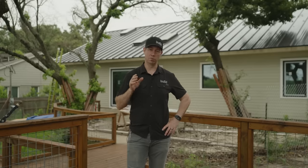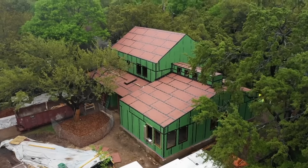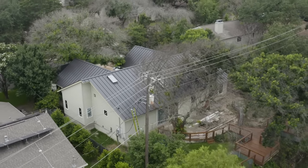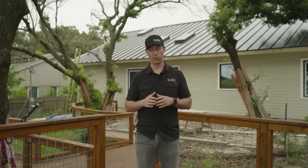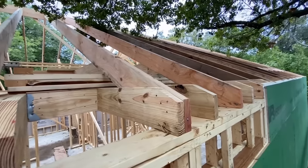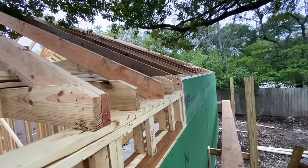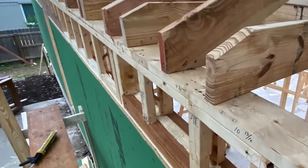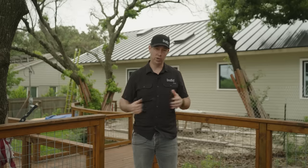We're talking rooftop insulation and metal roofs. Let me review the assembly on these two houses. I framed both these houses in a non-traditional way — I use what's called perfect wall or monopoly framing. That means when we frame the roof, we've actually clipped the rafter tails so they don't protrude through the wall sheathing. The wall sheathing goes up and actually touches the roof sheathing. I've used zip system sheathing on both houses where the zip system wall sheathing can actually be taped to the roof sheathing, giving me a very airtight and watertight exterior envelope.